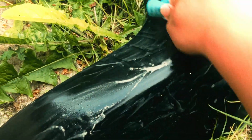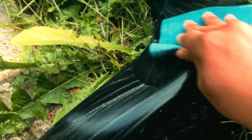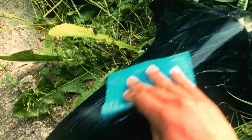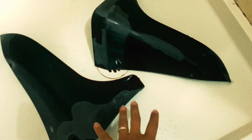It's hard for me to do it with one hand but it's much easier with two — you know, with my phone filming. As you can see it's starting to dry up now. I'm gonna do another sanding pass. The gloss is gone, it looks pretty good — this is what you want it to look like after sanding, from gloss to this. I'm just gonna wait for it to dry and then do another sanding.